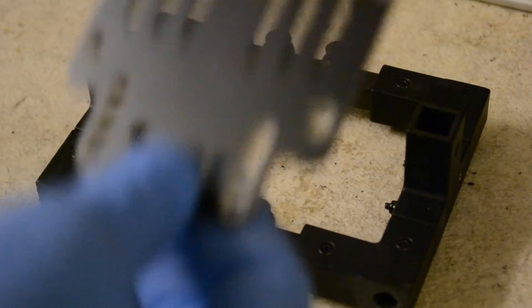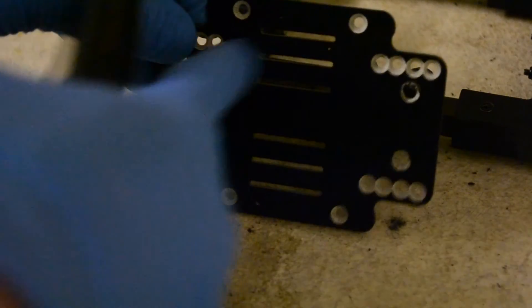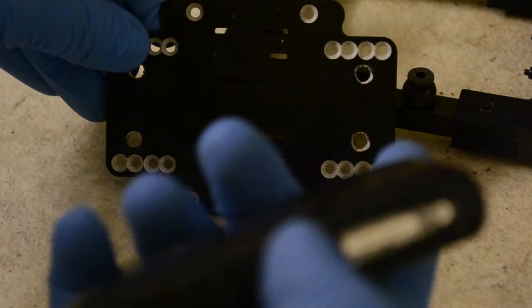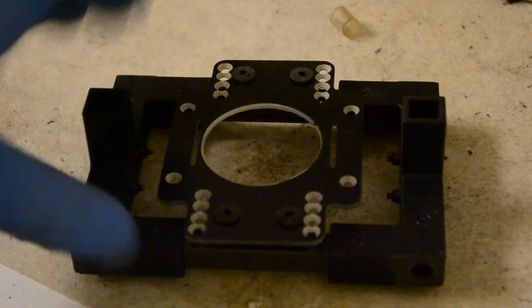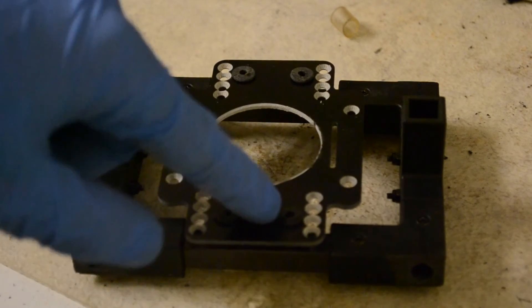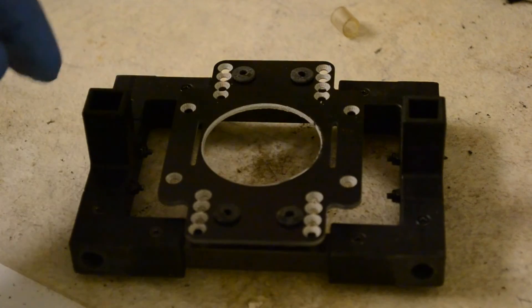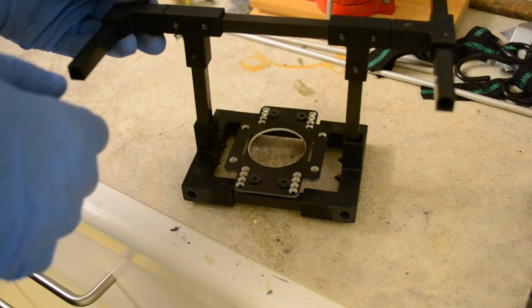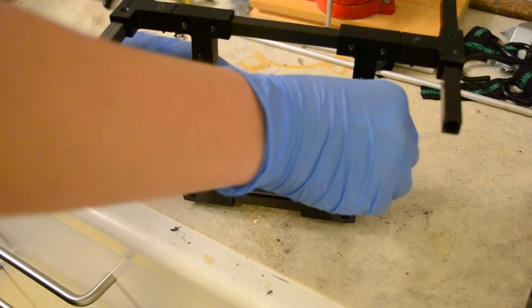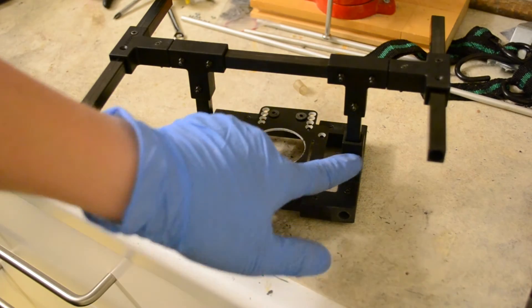Mount the vibration dampening balls in the frame, but don't mount the plate yet. If you're going to mount a camera — like a Canon or digital camera — we want to cut out a circle for the lens first. Once you've drilled the hole equivalent to your camera lens, go ahead and mount this plate on the vibration dampers so you have a vibration-free platform for your camera. Mount this on the top part of the mount, push these completely in, and mount a bolt and nut through here.